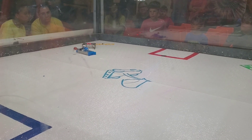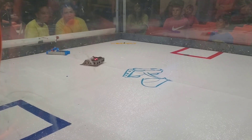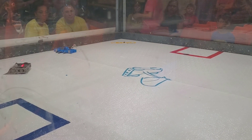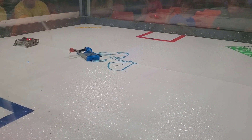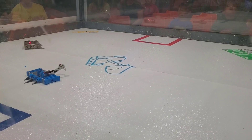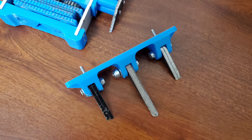That was really awesome to see and I really liked his robot. As far as the fight goes, I keep taking some hits and there's not really much I can do. The wedgelets keep working great, but without the weapon there's really not a lot I can do. I do end up making it to the judges with really no damage other than the spinner, and I end up losing this fight by unanimous judges decision. The shaft just completely sheared off. I'm definitely going to have to change this part of the design. The wedgelet rack with one long wedgelet in the center worked really well to get under the drum, so I'll definitely use this again against any drum spinners I fight.